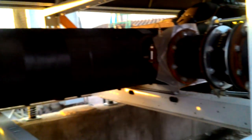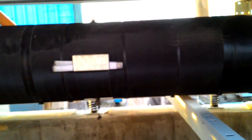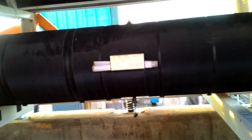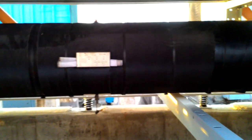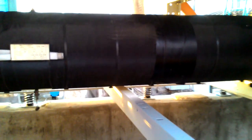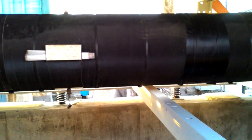In simple terms, I will tell once again. In the evaporator tank, the refrigerant is at low pressure and low temperature, and the chilled water return exchanges heat in shell and tube form. In the tubes water is there, in the shell refrigerant is there. Then after exchanging heat, when the refrigerant converts into vapor form, it goes to the compressor, and then the process continues.